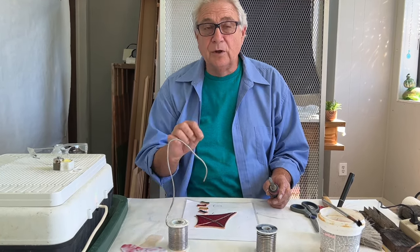Since we've been talking, my rheostat has been sitting on number 8. I'm going to bring my soldering iron up and show the camera that the tip on my iron has not turned blue or black or any other color. It's got a little bit from sitting on it right here, but I want to show you what I do with that. When I wipe this off, it's going to turn almost a light blue silver and a gold. Look at that. Okay. See that?